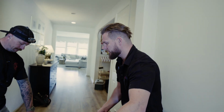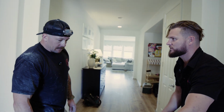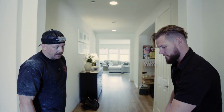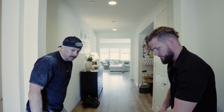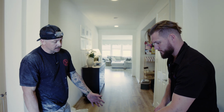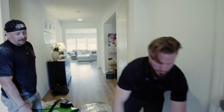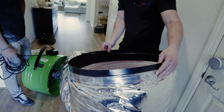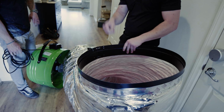Okay. Does it matter what side is what if you get them mixed up in the attic? Is there a side that goes to the damper box? There's a side that goes to the motor head? It's not going to make a difference other than ease of installation. This side, because it was formed around the motor head initially on assembly, it will go back on the motor head a little bit easier. This side, because it was pushed onto a damper box, has got a little bit of an oval to it already. That'll be easier to get back onto the damper box collar.